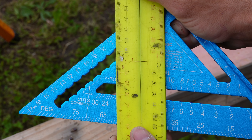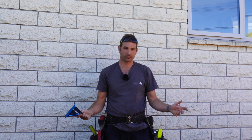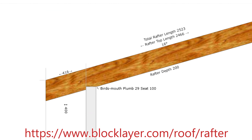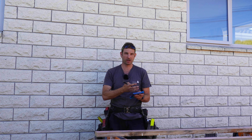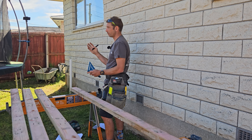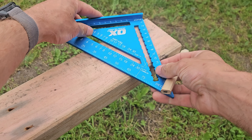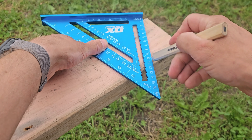I'm going to use a 35 degree angle, which lines up with 7 on your rafter cuts. Let's say we are cutting a rafter — we won't worry about the length, that's something for another video, there is some fairly complex maths and nowadays most builders will work it out using an app. The first cut we want to make is a plumb cut, which goes up to your ridge beam. On the speed square you're measuring 90 degrees out, so your plumb cuts will be 35 degrees. To mark that, get the pivot point on the length of timber and move it over so that on the same side of the timber you've got your 35 there.